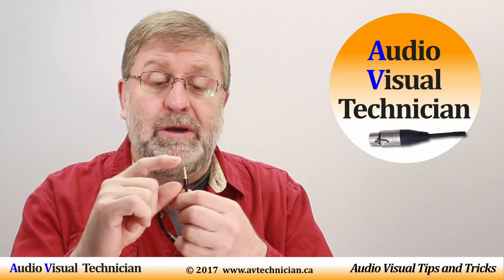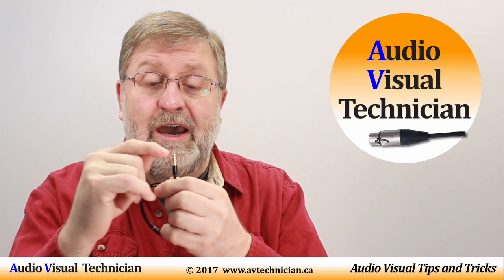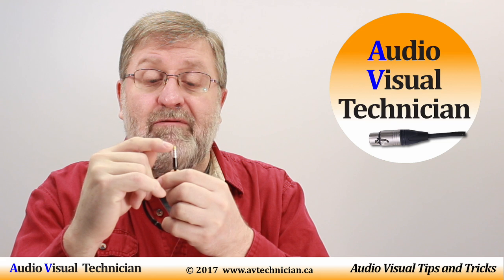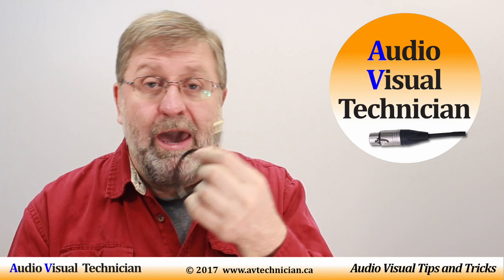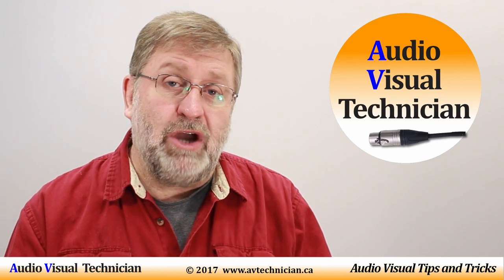The single jack is a little mini jack like this, and it actually needs to have 1, 2, 3, 4 rings in order to be able to work. This is referred to as TRRS — Tip Ring Ring Sleeve. This is the type of jack that is used to allow you to put both microphone and to hear sound coming from that one jack.